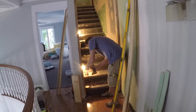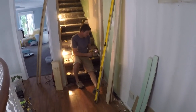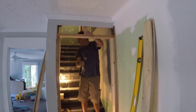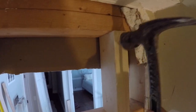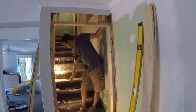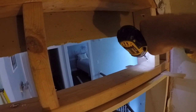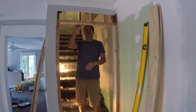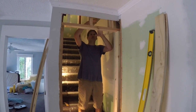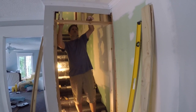So now we can finish mounting this with our trusty impact drill — these things are awesome, if you don't have one you've got to get one. We're putting in cripples here, but they're good for when you attach the drywall. If you had a header here, depending on how thick it needed to be, you'd have cripples above it spanning the gap between the top of the header and the bottom of your top plate. But for our purposes, this is just for drywall — just something to screw to once you're done.